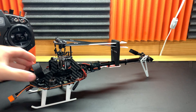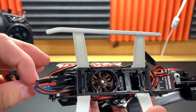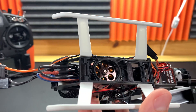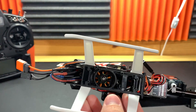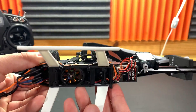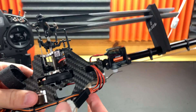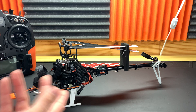Now let's look at the ESC. The old ESC was a 20-amp unnamed unit — probably a HobbyWing. Now they're giving you the Avian ESC, which is a HobbyWing ESC, but you can plug in and do some tuning and change things. It's 15 amp versus the old 20 amp, so they've actually dropped the amperage. Bigger motor with higher KV and a lower amperage ESC — I wonder if it actually spins around the same RPM. But the Avian ESC is easy to work with and tunable.